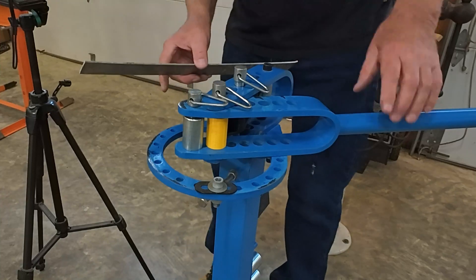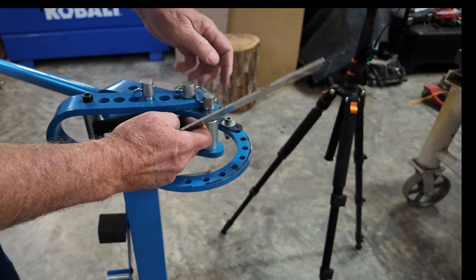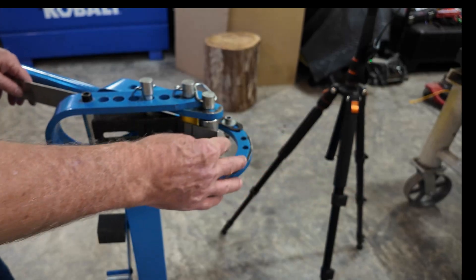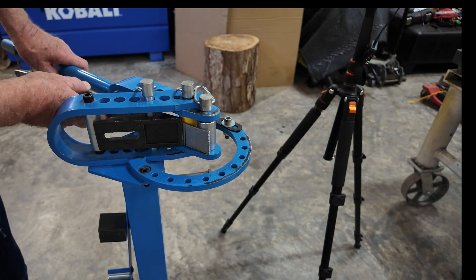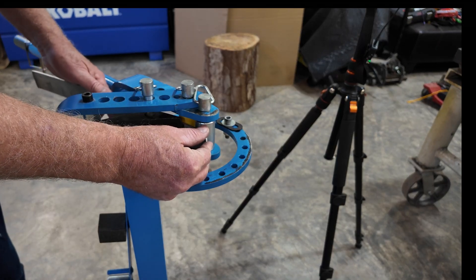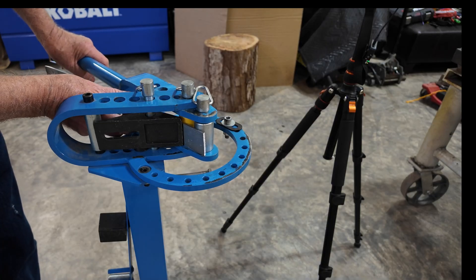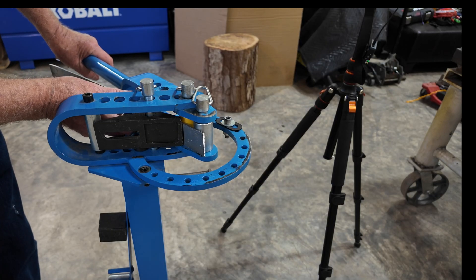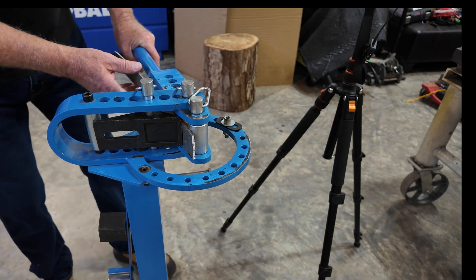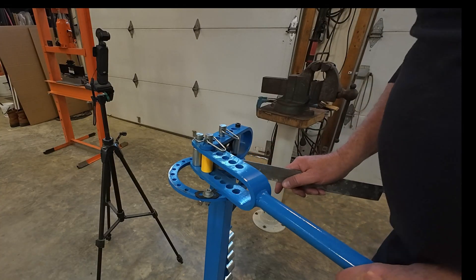I have the mark where I want to make the bend. So it's simply slip a piece of metal between the 90-degree bending attachment and my 3D-printed bold yellow die. Then just line up your mark — I just put a mark there for demo purposes, but line up your mark where you want to make your bend. And put some pressure on it. Since this doesn't really matter a whole lot, it's not a real bend, but go until you hit the stop.